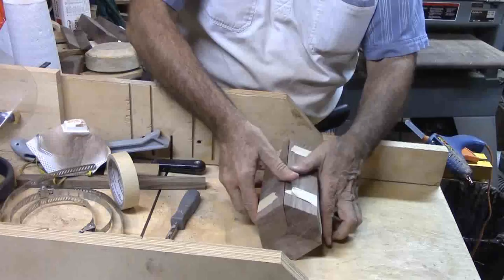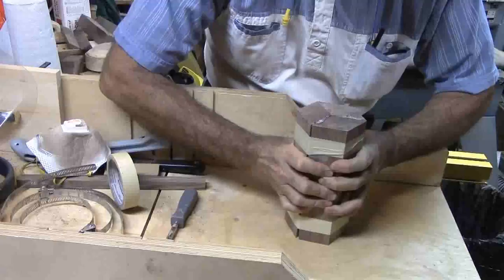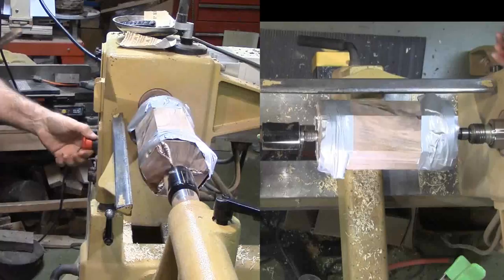Since this is a three-piece inside-out, the angles are 60 and 120 degrees. I've laid them out with tape to guide them together. I'm trying to use hot melt glue for the temporary bond. Since I don't completely trust hot melt with spinning wood, I'll leave the band clamps in place while I turn it. But I'll have to duct tape the loose ends down.